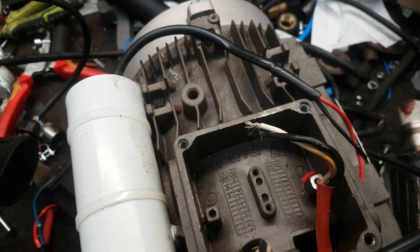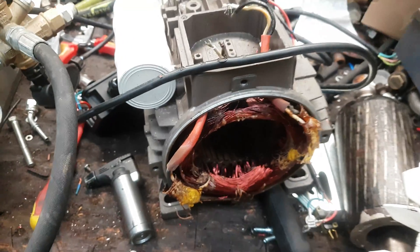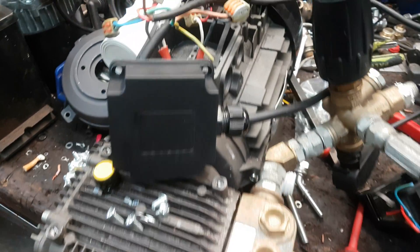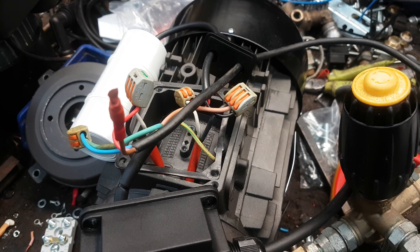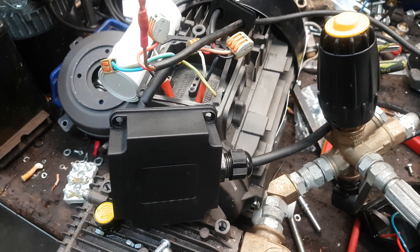That is not safe. The system itself has no form of safety — no thermal overload whatsoever. So if you're using the wrong size jet or a fault goes wrong, this motor has got no protection. And it will happen again, because the system is meant to be running at 11 amps, and this is going up to probably 14 amps, continuing to run.